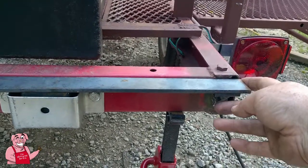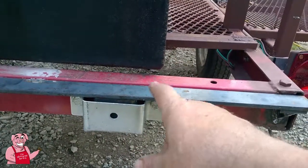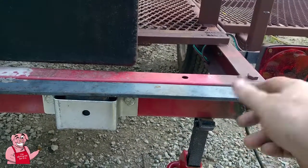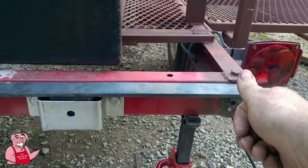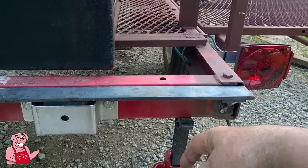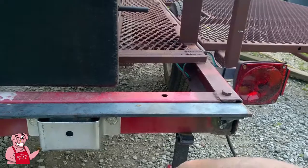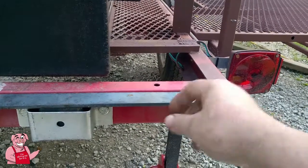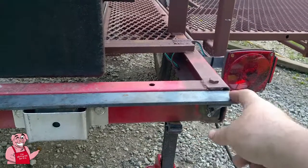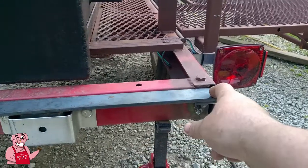The only thing securing it will be back over here and at the other end, and then at the other end of the trailer, exact same way. So I'm going to take this up 7 feet from right here. There's going to be quite a lot of weight on this thing, and that's the reason why. Plus, not only the weight, we're also going to have the stresses of travel, hitting bumps and whatnot, that's going to compound the effect of weight on this.